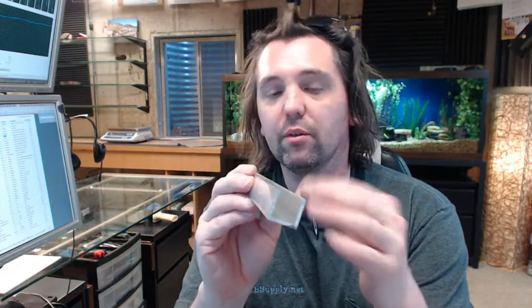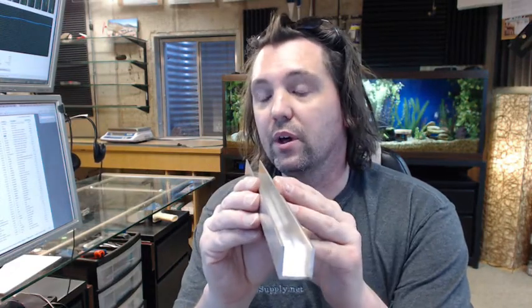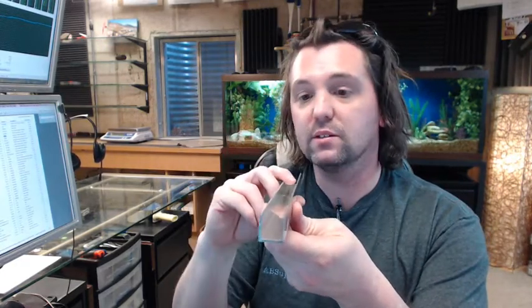This is going to be used exclusively with Pemko's 106R/94 or 106HF guides. This gets attached to the floor — mortised if it is a wood floor, surface mounted otherwise — and then your guide attaches to the bottom of the door as shown in the drawing and simply rides in there.